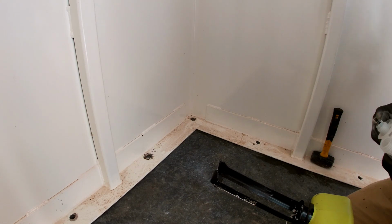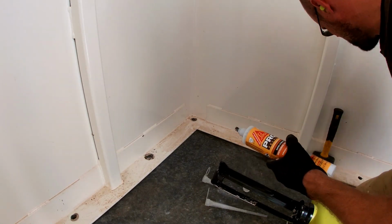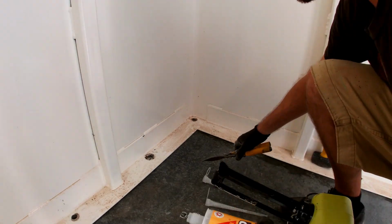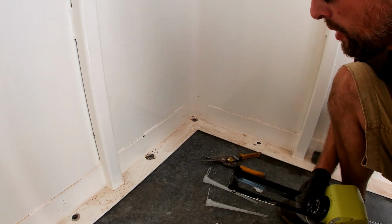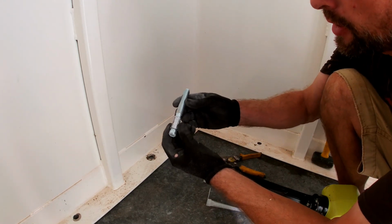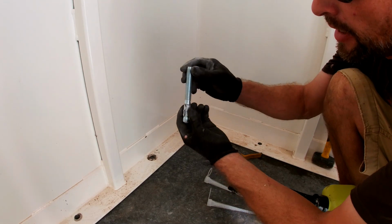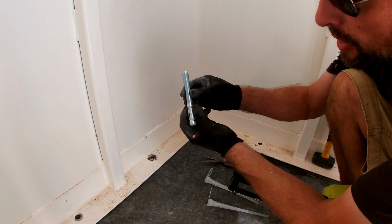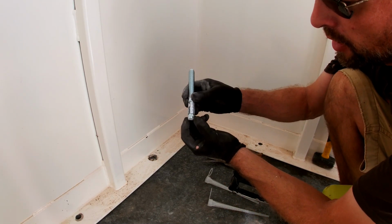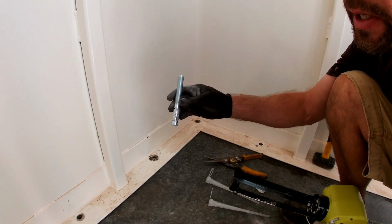When we put this storm shelter in, the guys knew we were going to be moving it, so they told us how to get the anchor bolts in. So these are self anchoring anchor bolts, I guess, with this little slip ring here. As you knock it down in the hole, as it pulls up, this compression wedge pushes this piece out, and then it locks it in place.